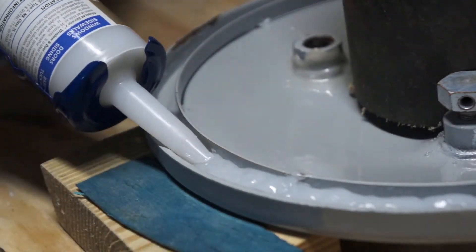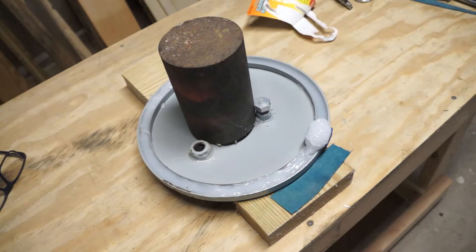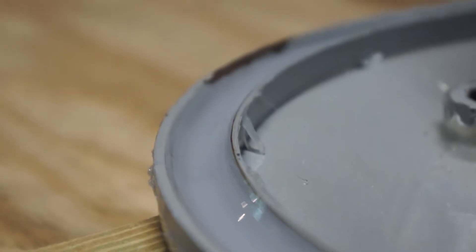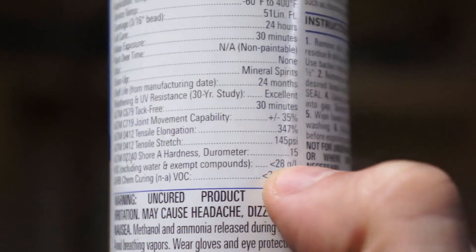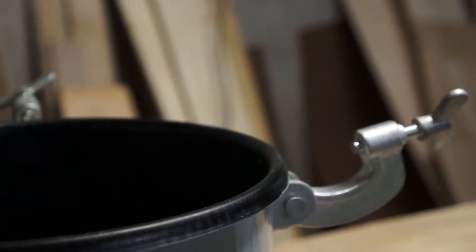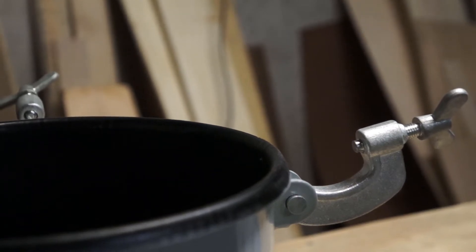I filled the rim of the pot lid with 100% silicone, then drove my printed part around the edge. It turns out I used way too much silicone but that's alright — better too much than too little. I went around the lid until the surface of the silicone was free of bumps. This silicone is 15A durometer, which is really really soft. Something a little harder might last longer, but I wanted a softer gasket as the rim of the pot is kind of wavy and not super flat. The intention is that the silicone will deform and take the shape of the rim when the lid gets clamped down, giving a better seal.